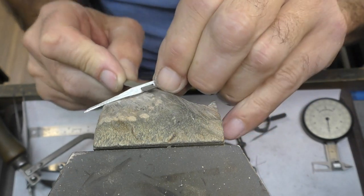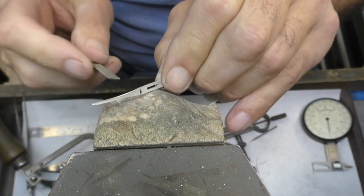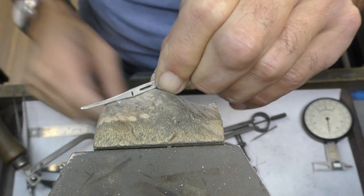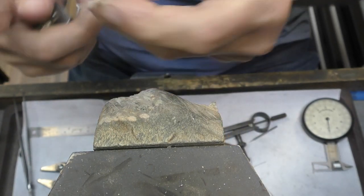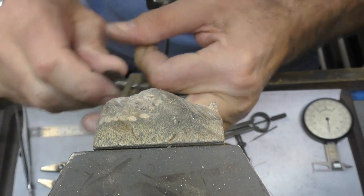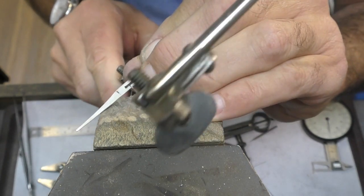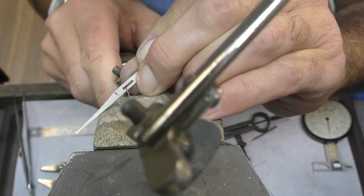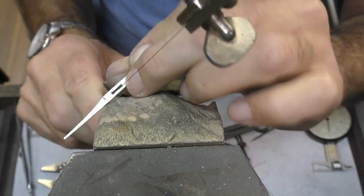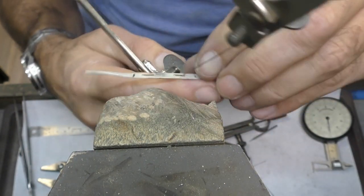If you're lucky you might be able to find a needle file that you can fit in there just to tidy it up. Otherwise you can just use your saw blade and do the sideways cut, which turns your blade more or less into a file. You're just pretty much going straight along the cut line, but it's scraping the metal off rather than cutting it off.